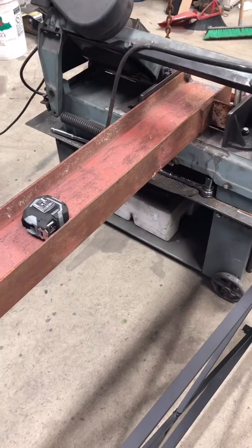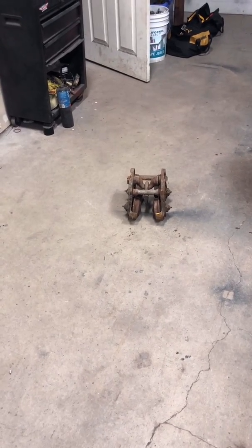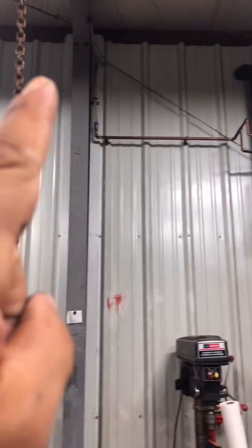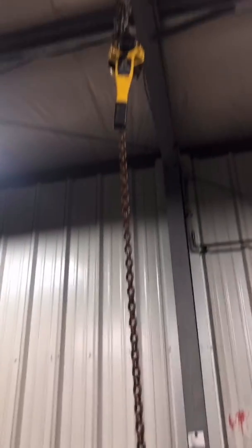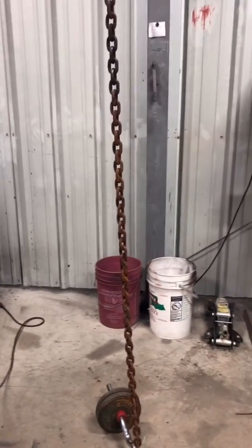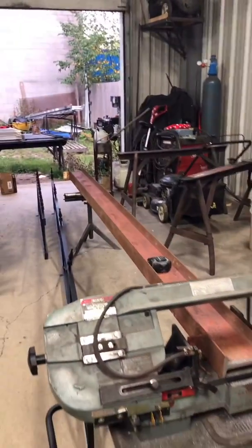The same beam would cost me $300-$400 new. And right over here I got this trolley from my cousin's farm. It still runs good — it's got a little bit of rust, but nothing a clean-up and a new yellow paint job can't fix. The beam is going to be hung about 9 feet tall. It's got to clear the top of my roof where my washroom is, and come over here to pick things up in the welding area. We've got a come-along set up when the beam is ready to be lifted. I'm just starting to get all the pieces of the puzzle put together.